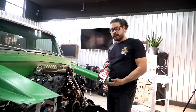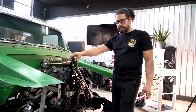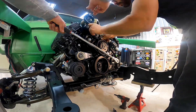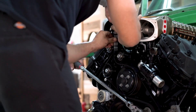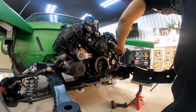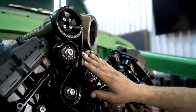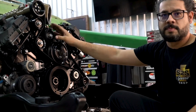We have a Gates belt that comes with the supercharger kit. You still utilize the stock auto tensioner as well as the manual tensioner on the Whipple supercharger bracket. It's a bit of a sequence and sometimes could use two people — we have a large breaker bar to take tension off the auto tensioner while setting and tightening the manual one. It may look complicated because there are so many pulleys, but the best thing is to follow the manufacturer's instructions. Whipple provides a great routing diagram starting at the crankshaft dampener, through the normal accessories, and up into the additional idler pulleys and tensioner. Any slippage on the belt directly correlates to power loss, so keeping proper tension is extremely important.